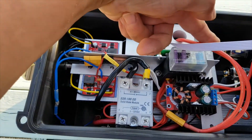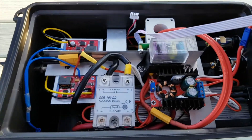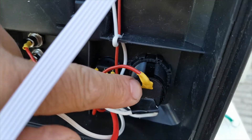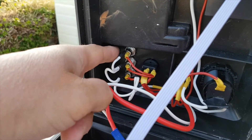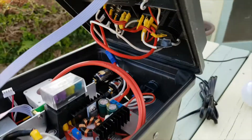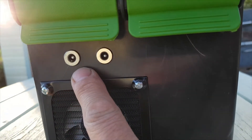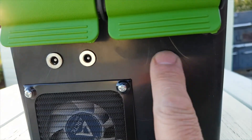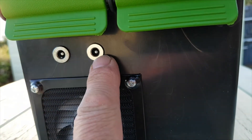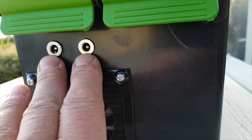Unfortunately the main battery positive has to go through this unit so it can measure current capacity and power requirements. In the lid I've got USBs — this one is a QC3, this one's a standard USB, and there's another USB down the bottom. I've got 5.5 by 2.5mm outputs as well, for tent lighting and that sort of stuff. The fan draws air right through the cells. These are the solar inputs, and I'm going to add another input on an XT60 for the mains charge. These will take 50 watts of solar each, so you can charge at 100 watts, which over the course of a day should be sufficient.